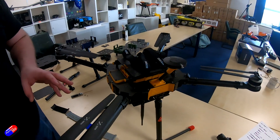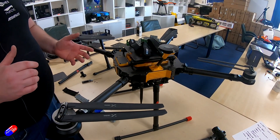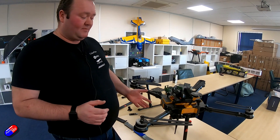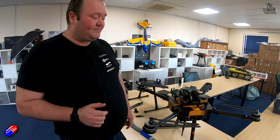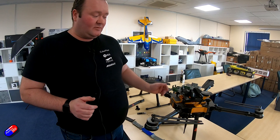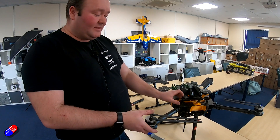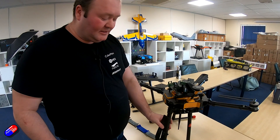The one you see here is going to be flying at about eight kilos — quite a big drone — and will carry about a one kilo payload. The customer wanted the flexibility to mount different sensors on the bottom. The batteries are on the top but it's designed so that batteries could be top, bottom, or both. The sensor could be on the top and it's semi-portable, so the folding arm joints quickly fold down.